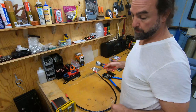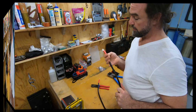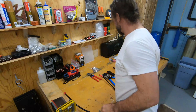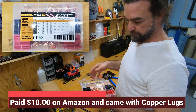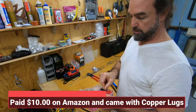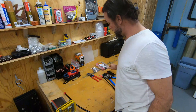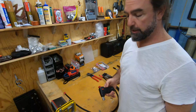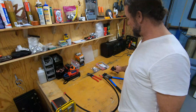You're going to need something to strip off the plastic wiring. These cables are extremely rigid — they don't like to bend. The other thing you're going to want to have is some shrink wrap. Buy some good quality shrink wrap. Basically slip these on over the wires, and once you finish the crimping job apply a little heat — a little butane lighter — and it will shrink right up and make a professional connection.